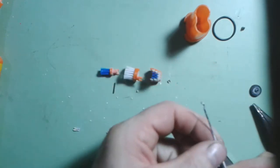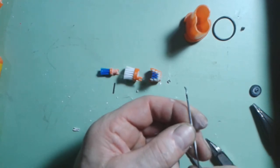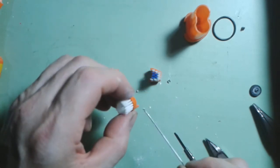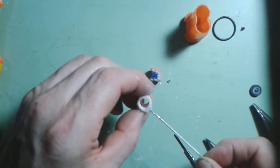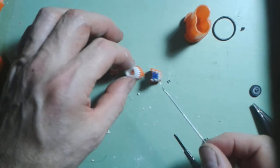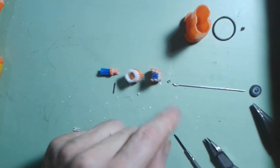Notice the end of the drive shaft has got a tiny little crank in it — it cranks around, moving from left to right as it turns. That's going to give our little bit of operation, moving that part left and right depending on the rotation. So that's all that's happening: it's spinning at high speed and turning the head left and right, held in place by this tiny little C-shaped bearing.